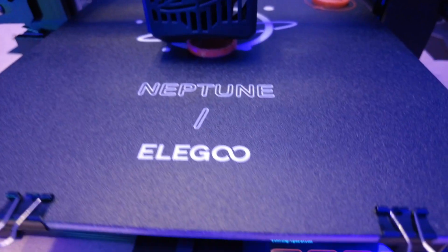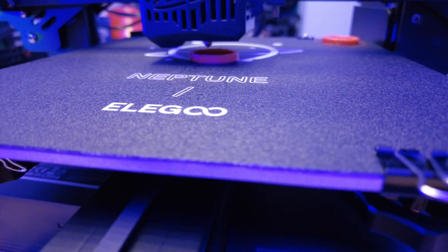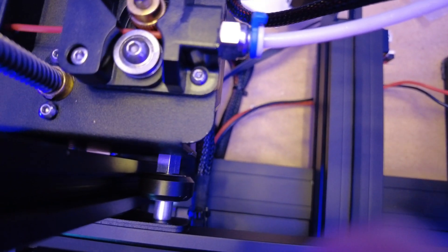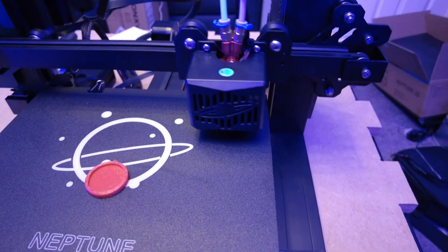However, I just wanted to touch on this bit of the video when the blockage happened. I don't know if you can see that, but actually the print is beginning to fail already. Yeah, we've got a gap there now, which is a bit of a shame. So that really does suck. My suspicions on this are going to be quite correct, I think — you're going to get some serious heat creep with this particular nozzle because of the way that this is set up.